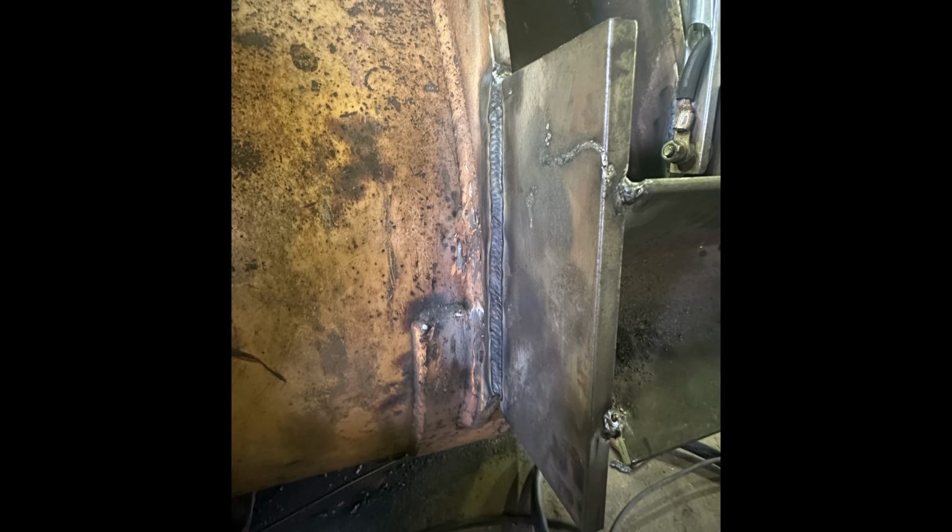And the reason you don't want those on what you're welding, and this is mistake number 2, is that will cause a location for a crack to occur. If that's stressed tremendously, I wouldn't be shocked to find a crack there. And if you just grind the surface down, it doesn't necessarily fix it, especially with high strength steel. You don't want to do this, so be more careful than I was. Anyways, you can see pretty much capped up, looking decent, I mean, for what it is.